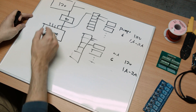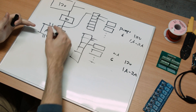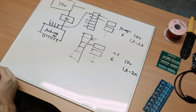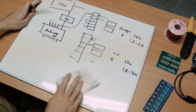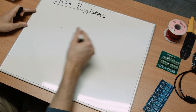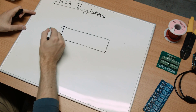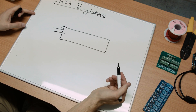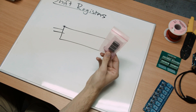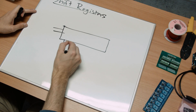There's another problem: since the Arduino only has a certain number of output pins, we can't just wire all the output pins up to all of these relay inputs. The answer to that would be a shift register. What shift registers do is basically allow you to convert two inputs to several outputs. I got these shift registers online — they're basically just a chip that you hook up on a breadboard or on your own PCB board, and they have eight outputs.